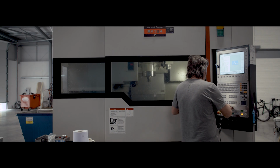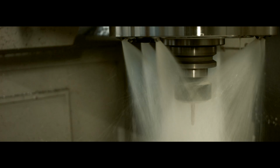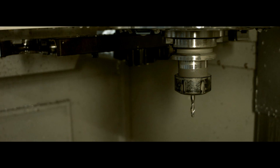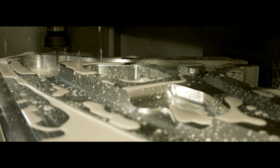We start off with a big slab of aluminium. We get it water jet cut to the rough shape of what we want the mould to be. Each half weighs about 48 kilograms. You go in with as big a cutter as you can to rough it all out, get the main of the meat out, and then you come in with a ball nose cutter which does the fine detail. This join line, there can be a step on it, and you've got to sand that step out.